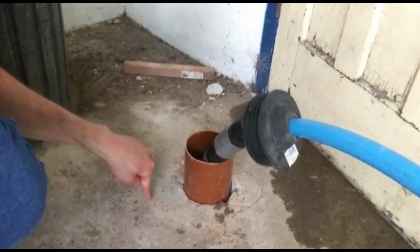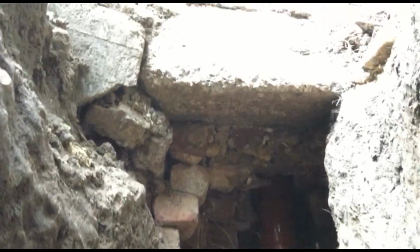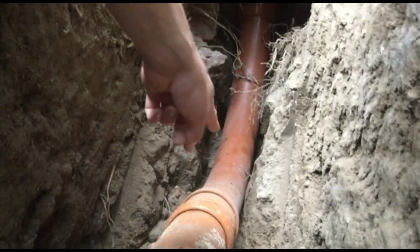So this pipe is actually just insulated all the way down to its bend at the bottom, and then once it gets out from the bend and is 750mm or more below the ground, it's no longer insulated. So you can see the little bend that I've got going on underneath. I'll show you. So you see there's like an elbow under the ground that goes up into the raft. It's only insulated until the bottom of that elbow, because it doesn't need to be insulated anymore.